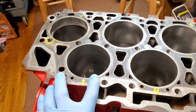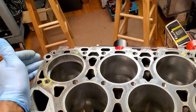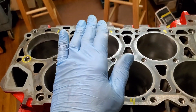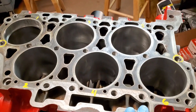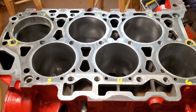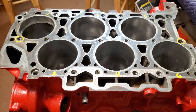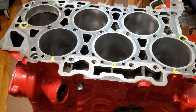Cylinders three and five would see pretty hot intake temperatures passing along these other two. It's really crucial that we run good coolant and have an efficient radiator to keep temperatures low, so we're not putting hot air into the cylinders — which will already generate heat from a turbocharger running high boost. Tuning is going to be very crucial. We're going to be running E85 race fuel, and that will definitely help drop down some of the temperatures. So this engine is going to be pretty unique as far as tuning.